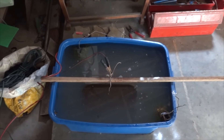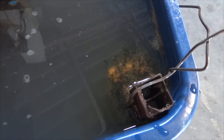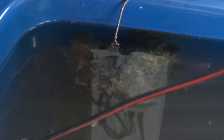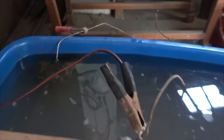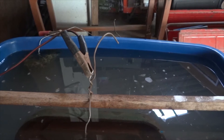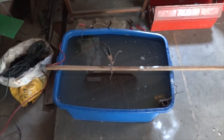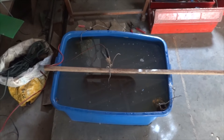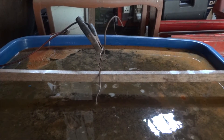It's been maybe five to ten minutes and I came back. First, look at the sacrificial rod — look at all that action happening around it! It's only been a few minutes. The other one over there is a little further away — I'll zoom in on it — you're getting the same kind of action, which tells me I've got a good connection. A lot of people worry about the connections and use copper, but you can run copper on the outside; just don't put it inside. We're going to let it sit, and the way it works is when the part turns all black, it's probably done.